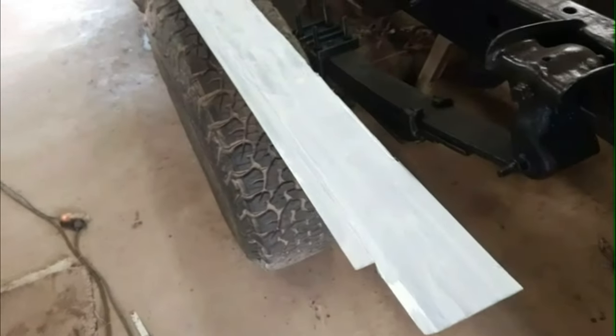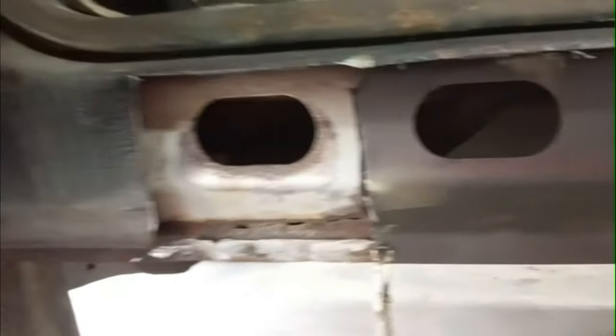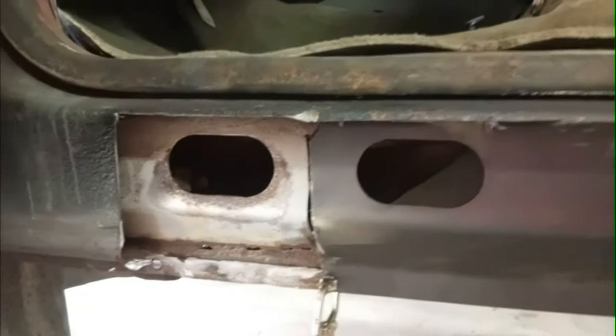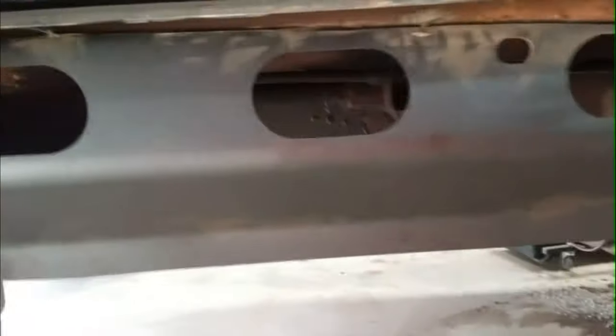All right, so driver's side here. Got the outer panel all cut, inside painted. And just finished test fitting the middle piece they call the inner panel. It's looking pretty good. It needs a little trim at the bottom here. It'd be nice if we could have gone a little further, but it is what it is. And I'll be ready to weld that on there. And then I also cut a piece for the center or the inside here, the back, where it was a little rusty there.